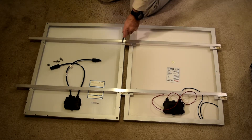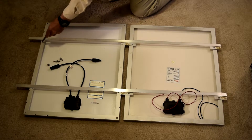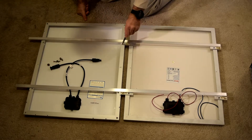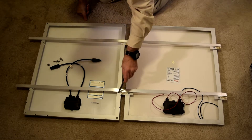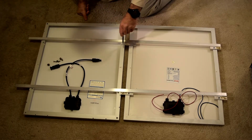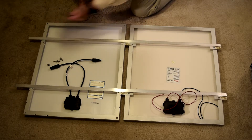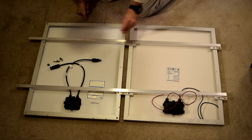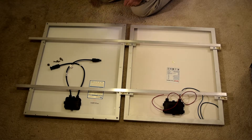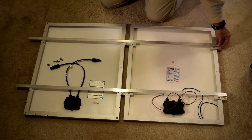This panel also conveniently has some holes drilled in it already and I think I can reuse these two, maybe these two — I'll just have to see how it lines up. I might have to drill a new hole here and here, but that will be about it, as well as the holes in the flat bar. So the first thing I'm going to do is mark the flat bar for cutting because it's a little longer than I need. So I'm going to line it up for length with the existing tabs right there.